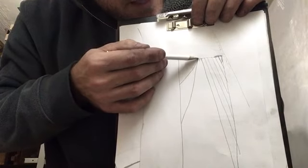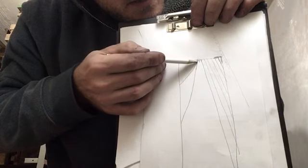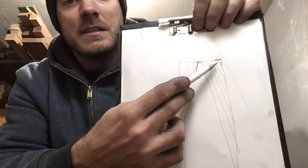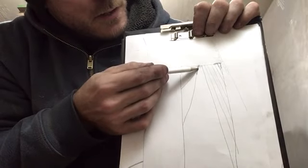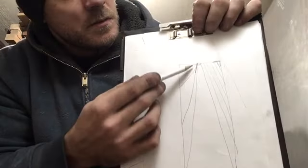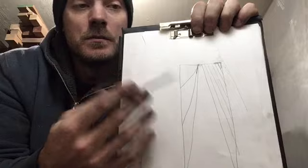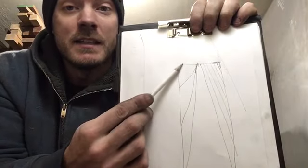So now the angle that your belt is dealing with is this mellow angle right there. That's not hurting your belt nearly as much as a whole bunch of these things going on. And then your next one, same thing. You come in around the same spot, take off there, and so on. It's just a way mellower angle for your belt to be approaching, so you're not constantly chipping off grit. So that's grit shear. So avoid that by breaking your 90s and then slowly working up.